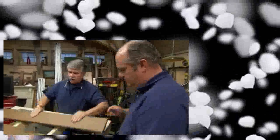All right, so do you always need a groove or a slot for these invisible joiners? No, there are a couple of different methods that you can use without a slot at all. So if we move this out of the way, I can show you this right here. This is a piece of metal that goes on the side of the joist. You screw it into the side, right like that. Then you lay the boards down on top, and you go down below the deck, and you screw the screws up through the holes into the underside of the decking.